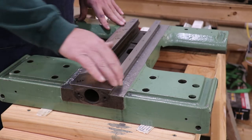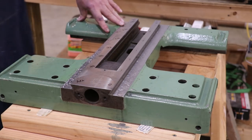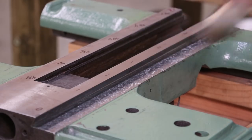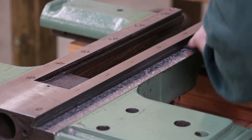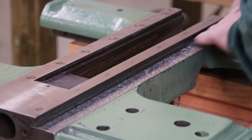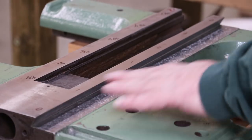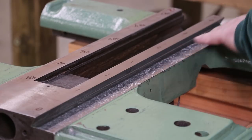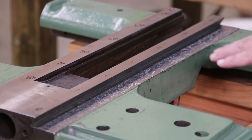I'm going to blue this side up, go through the process, and do a couple rounds of scraping. First thing we want to do is make sure this is clean - I'll take a brush and just go ahead and hit it with a stone. The purpose here is just to knock off any burrs, those really really high points. I'm not trying to stone this to make it flat, I'm just making sure we don't have any burrs that will give me a false reading when I come in with the blue.